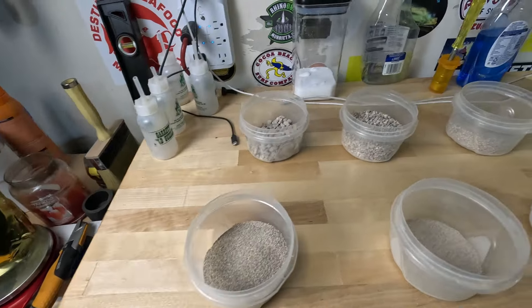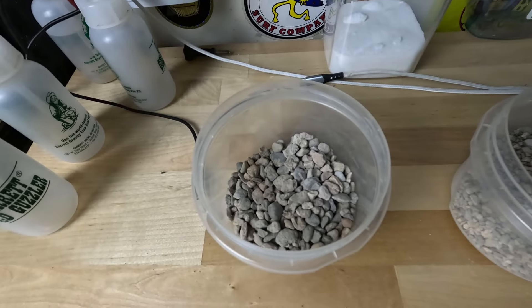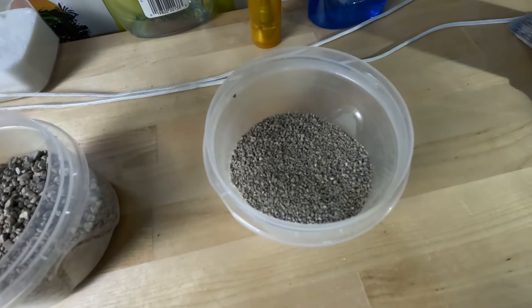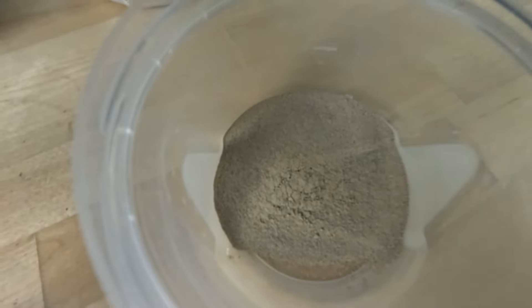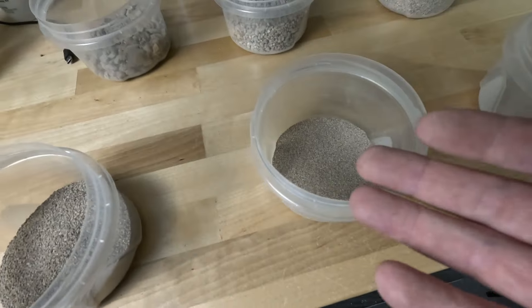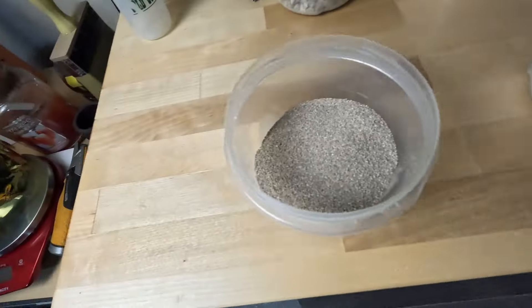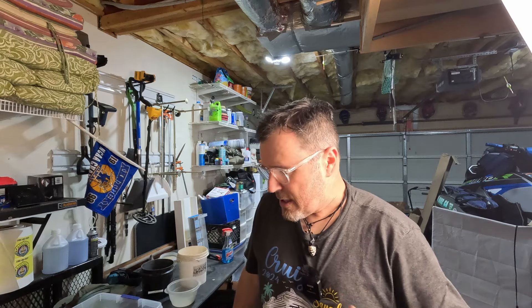Here are six classifications. We're going to start with the plus quarter inch, or plus four mesh, followed by the 10 mesh, 20 mesh, 40 mesh, 60 mesh, and minus 60 — that dust right there. What was strange about it: usually you get a lot of plus 60 and a lot of minus 60, but it's all 40, 20, 10, and quarter inch — barely any 60 and under.